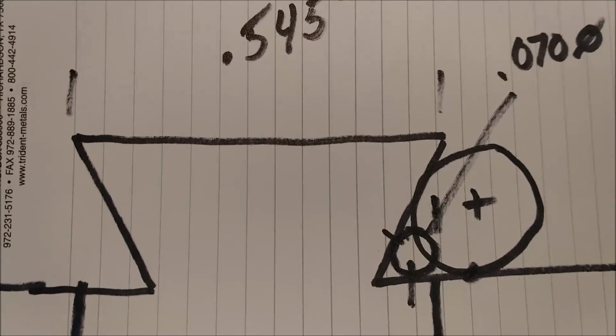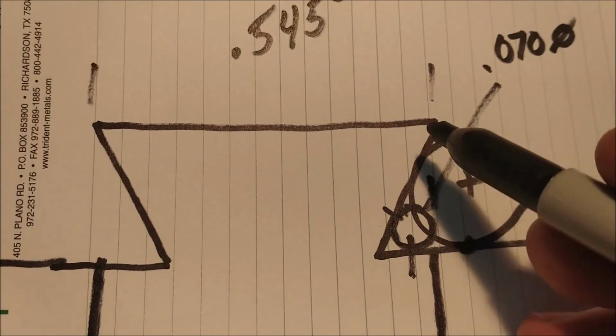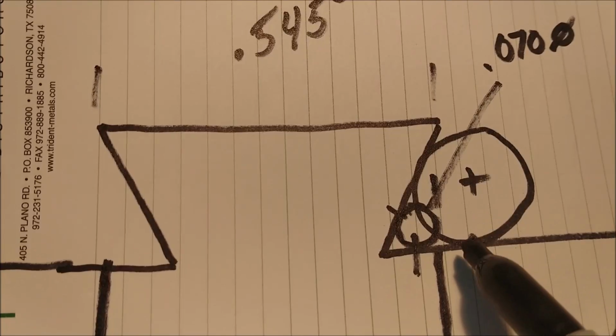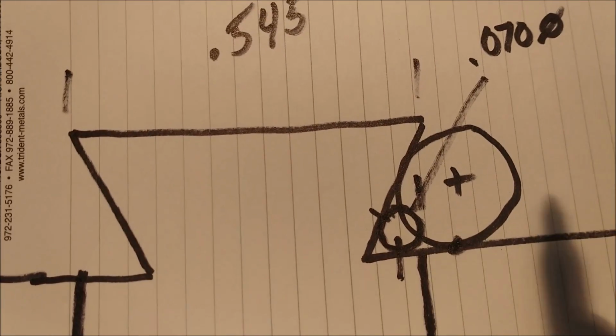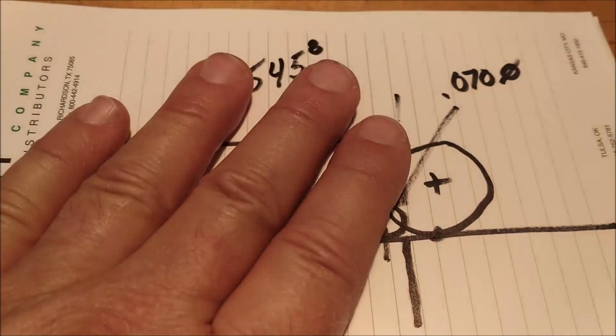All right, that's what I'm shooting for in the next frame. You cannot use the 126 pins outside the dovetail being 500, the part being 500. You've got a situation that would give you a false reading, so be very careful about that. Very important. All right, let's get back and finish the dovetail.